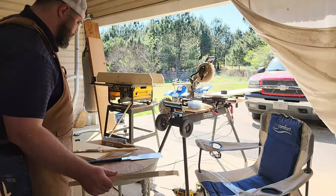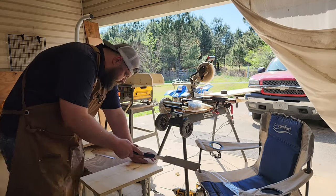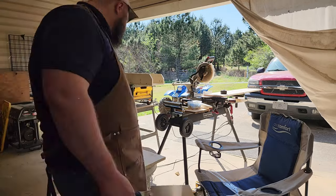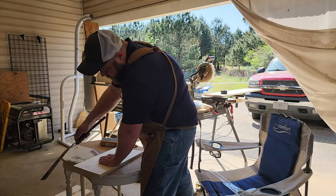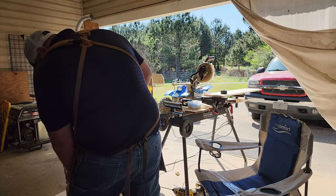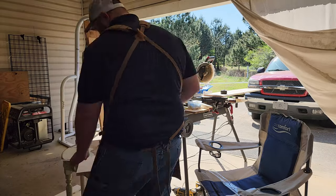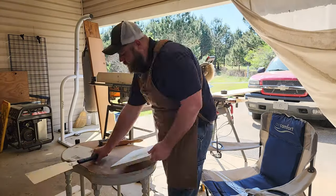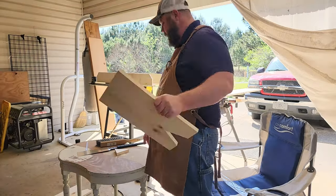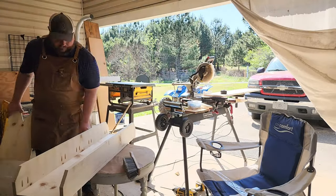It really is as fast as it looks, even though this is sped up, it's not sped up very much. You start your cut and then you go. I get frustrated when it doesn't start easy, and there was a knot right here that gave me a problem, so I cut through it real slow. Cutting through knots is a pain even when you're using power tools. And there we go — we got our triangles cut in. It looks nice and will give it a neat appearance. We're going to use pocket holes to join those in too.